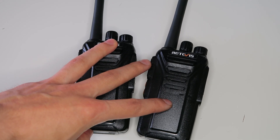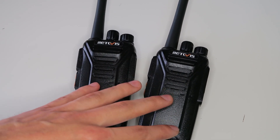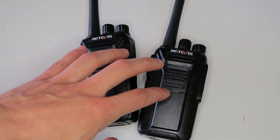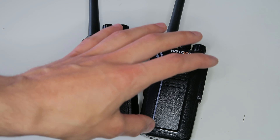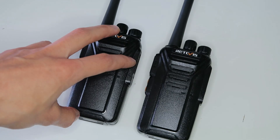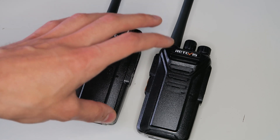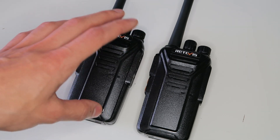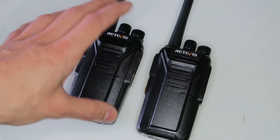The second interesting function is DCS Encrypt. This one is especially interesting because I've never seen it before on any other radio. This obfuscates the DCS code you're using, so that only other Retevis RT27 radios with the DCS Encrypt option turned on will be heard by your radio on that channel. It doesn't stop anyone from hearing you if they open the squelch manually or if they don't have any CTCSS or DCS codes on. All it does is stop people from being able to break into your communications. Some radios have a CTCSS and DCS scan function, so they could find out what code you're using, set it on their radio, and then you would hear them talking. The DCS Encrypt function stops this because they simply cannot find your DCS code.